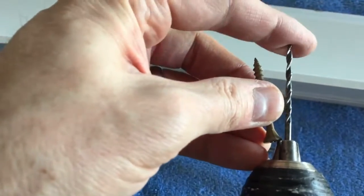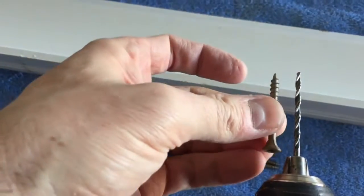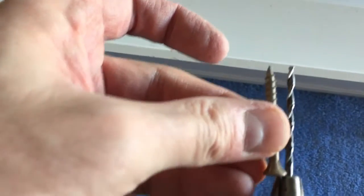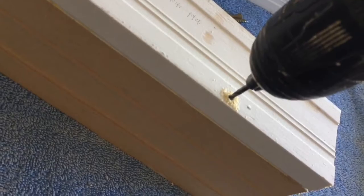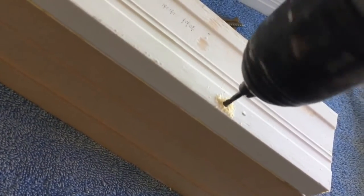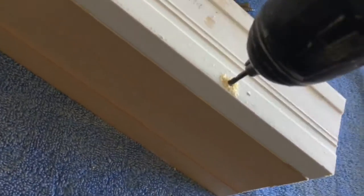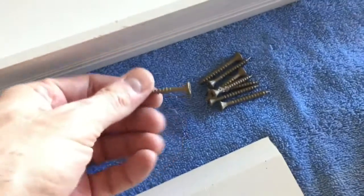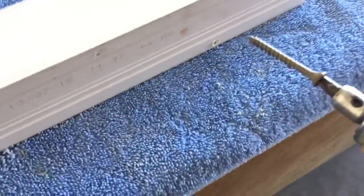Once you have a couple of nails in, I definitely recommend using some 2-inch screws. I have two or three of them that I'm going to use in each piece. And I mentioned that it might have an unsightly head, but this is the back, so it won't actually be seen, okay? And it's going to provide your ledge extra integrity to make sure no matter how heavy the books that you put on there are, it's not going to bend forward or detach in any way.